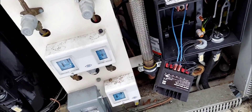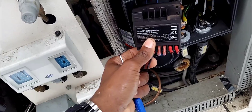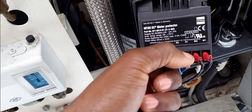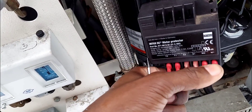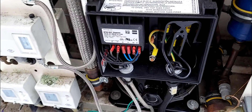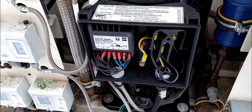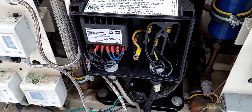If you want to bypass this safety - in case both of your thermistors are bad - the thermistor connects to S1 and S2. To bypass it, all you have to do is shunt the two wires connected to M1 and M2. If you open or pull any one of these two M1/M2 wires while the compressor is running, the compressor will turn off. I'd love to demonstrate it in real time but this is a critical unit and it might create issues for the client.